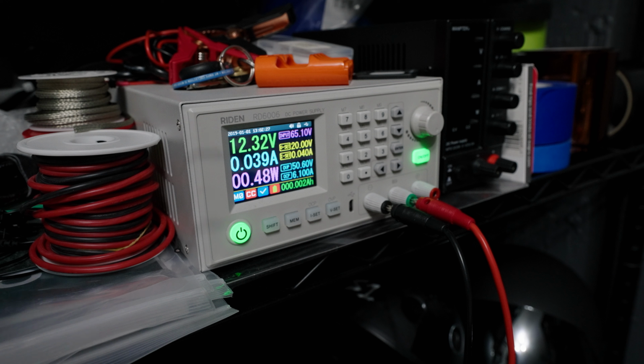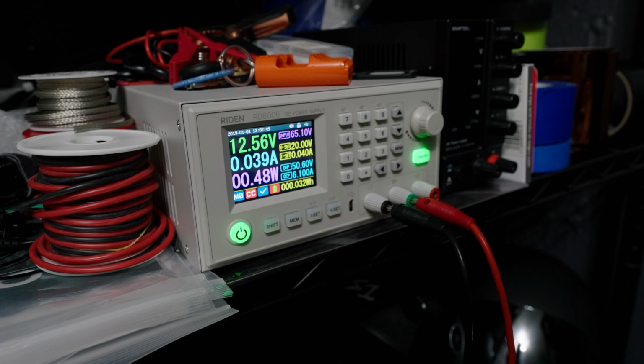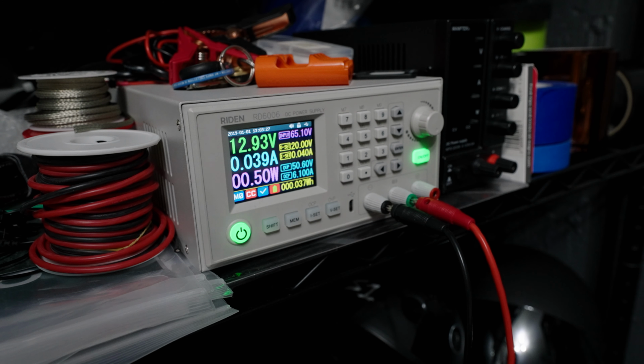Now, the issue is that we cannot control where it replates itself. It can replate itself nicely on the terminal. It can form in the electrolyte, just floating around. And these dendrites that form are spiky metallic structures. They can then lead to internal short circuits of the battery if they pierce the separator. They can also just damage the terminal, the negative pole of the battery, because when dendrites start to form at the pole, they then compromise the cell's ability to function as it used to in terms of electron transfer from the pole to the electrolyte through the separator, etc. I will link some literature on dendrite formation in the description below.